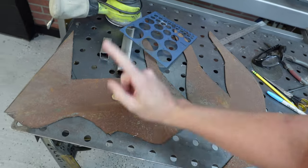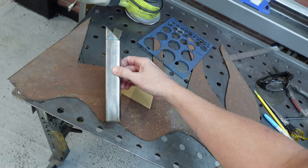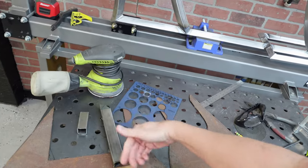We're going to take, what I think, if I cut this square tube down the middle on both sides, so that I have basically L-shaped metal. You know what I'm talking about. If I cut that, it should be able to wrap around the fork, and then if I can TIG weld some bracket to the end of it so that it can actually bolt, that would be ideal.